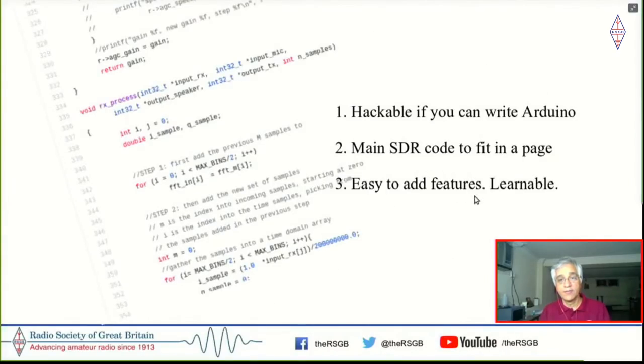Okay, now I haven't spoken about the software till now, and I will very quickly lead you in the last couple of minutes through the software. So the three things that I decided while building this SDR is that I would rewrite the entire software stack all over again, instead of using the software which is already available, because usually the people who write SDR code write it for a generic hardware, which is not completely optimized for any particular architecture. Second was that it was extremely complicated.